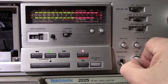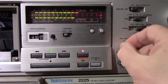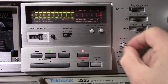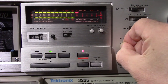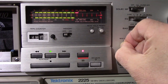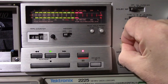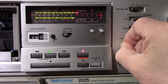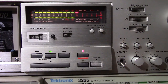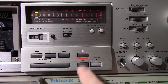Let's go back to the bias and check it again. The levels are much higher now because I took care of the record levels. We want to get these so that they're both the same — both red lights kind of flickering together, not too different from each other. Just like that — that is as good as it gets. Let's go back to record level and check it — that's spot on, they're good. This tape is calibrated.